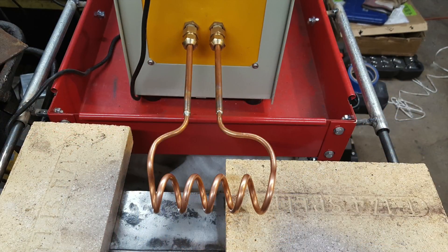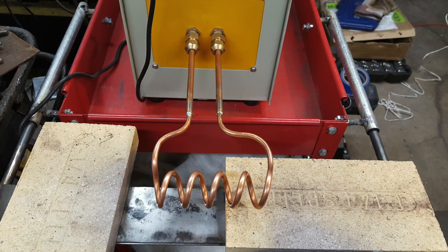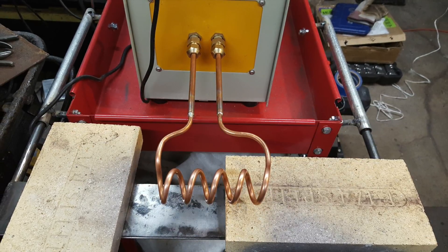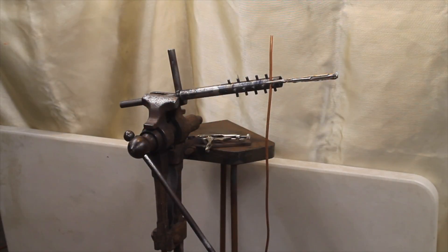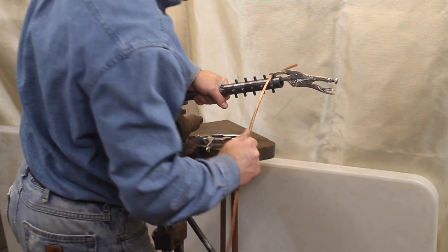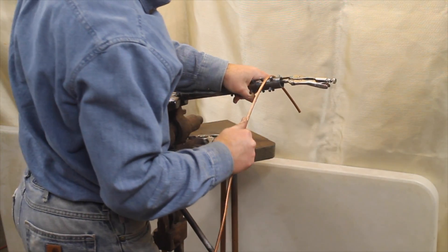This second coil is for longer heats. It is 6 inches long and made from 29 inches of 6mm tubing. The inner diameter of the coil is just over 1 inch. The asymmetry wasn't intended — I just misestimated where to start coiling. I clamped a lead of about 4 inches onto my winding jig; 6 inches would have been better and would have fixed the asymmetry. This jig wound a nice coil. I'll make a separate video detailing making the jig.